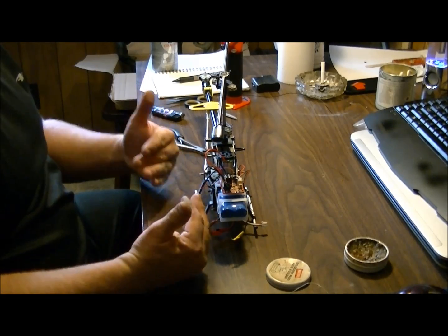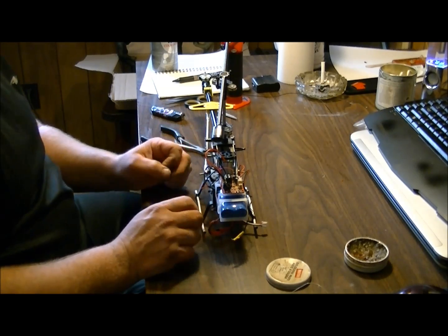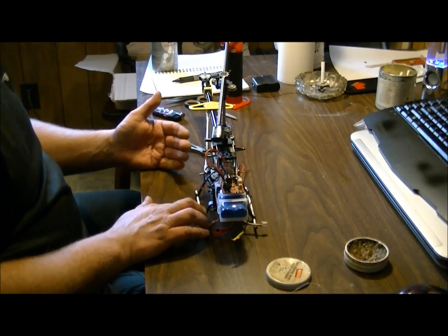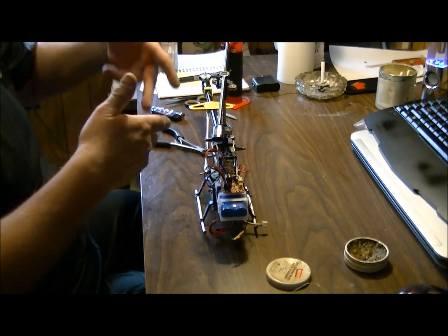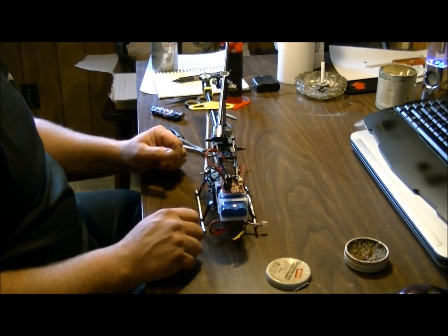Just remember, you can go off either the negative or the positive wire with a switch — it makes absolutely zero difference, because all you're doing is cutting power to the circuit or allowing it to come back on. But you only ever go off one side. Don't try to go off both sides because that's when you short stuff out and that's not going to go well.